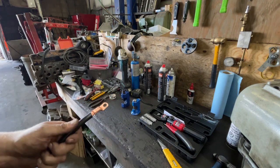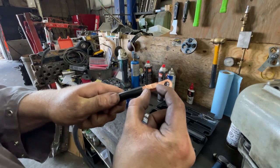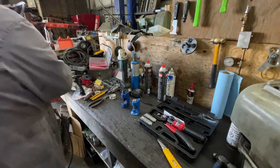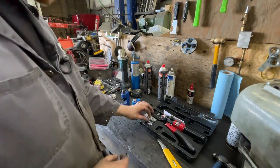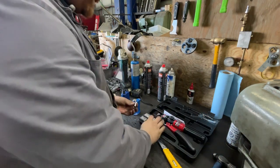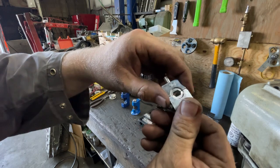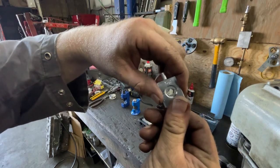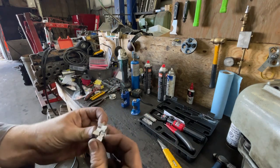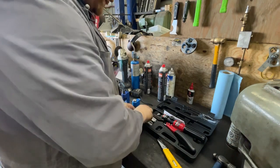The reason I crimped it twice is the width of the lug versus the die. I like to crimp the full amount as much as possible because that gives it as much holding power as possible. Now this tool — when the dies come together, that gap inside is a little too big for my liking. What I do is take them to the belt sander and sand them down a little bit to close that gap. If you can crimp it and then pull the wire off, it's not crimping tight enough. Not all brands are like that, but if you can pull it off just sand or file the dies down a little bit.